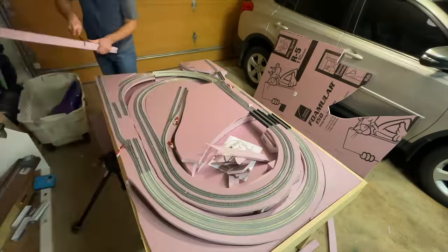And then after a day or so of drying time, I applied 3 coats of satin polyurethane. The poly coats give the wood a lot of protection, making it more resistant to damage, and also give the wood a much richer look. I do plan to cover the wood while I'm working on the scenery work going forward, but this way, if I do get any paint or glue on the frame at this point in time, it's not going to soak into the wood, and I should be able to clean it off fairly easily.